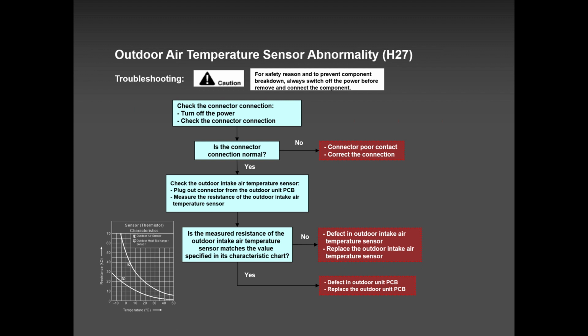So please check all the elements. Make sure everything is clean. Go with your multimeter. Multimeter is the best, not an amp probe, because in most cases our amp probes are not calibrated for sensor thermistor measurements. Use a multimeter. Most of the time, guys will call me and tell me it's reading OL, OL, OL.